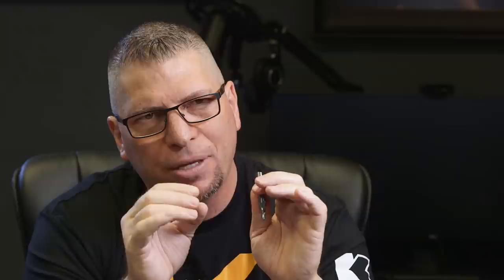If you have questions on thread mills and how to use them, we've put out a few videos. In one video I teach you exactly how to hand-program a thread mill — drop down, G91 over, come up — and even if you don't hand program, the video is worth watching to understand the mechanics. There's also a tutorial where I machine a giant Titan 1M out of Inconel, using a Kennametal thread mill with all the specs for successful Inconel 625 thread milling.